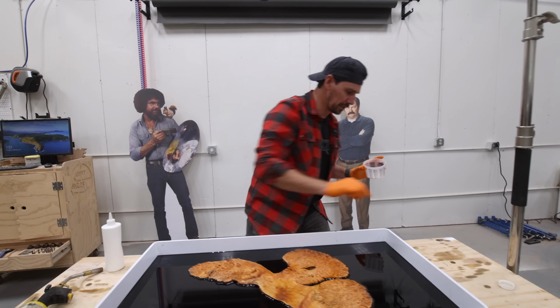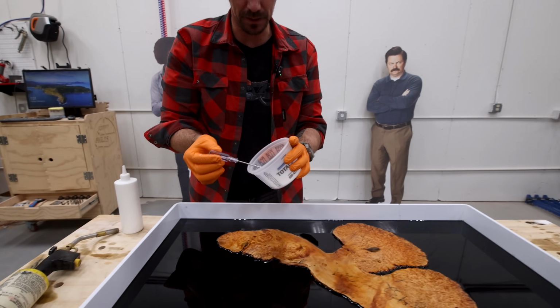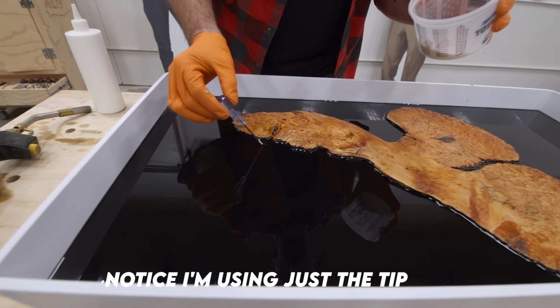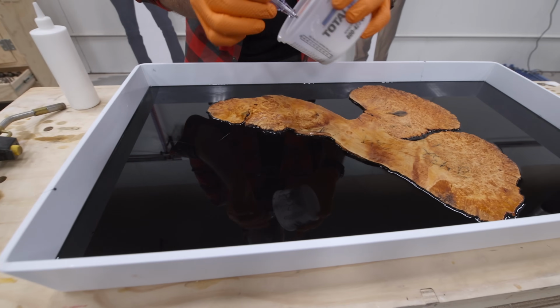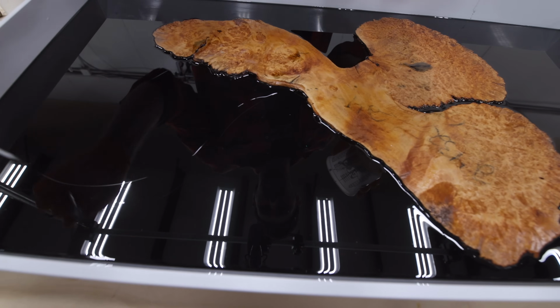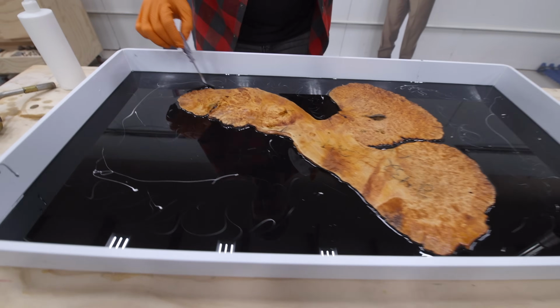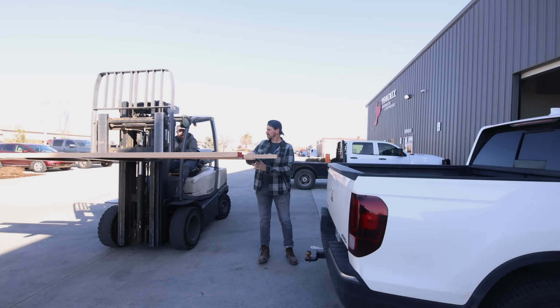I've got my little awl here, or pick, and I'm gonna take some of this epoxy and very subtly start working it into the black. This technique left a very subtle swirl that helps to break up the space around the slab and give the piece some needed depth. While that epoxy cures, I can start working on the base of this coffee table,